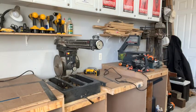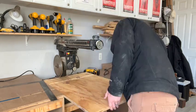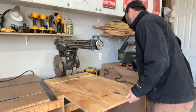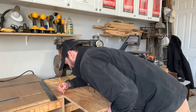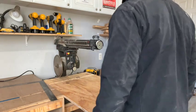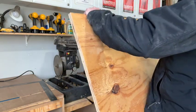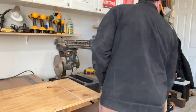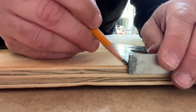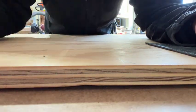Okay, now to start off we need to remake the deck for the radial arm saw. We're just going to take the existing piece that we had already on that cabinet and place it onto the radial arm saw. We're going to cut it roughly to the maximum depth of the actual tabletop. Now this piece is going to eventually be split into three pieces, but we're just going to cut it down so we can manage it a little bit easier. When you're marking this, just give yourself that little indication mark so you know which side to put the saw blade on so you don't make a mistake and make more scrap.